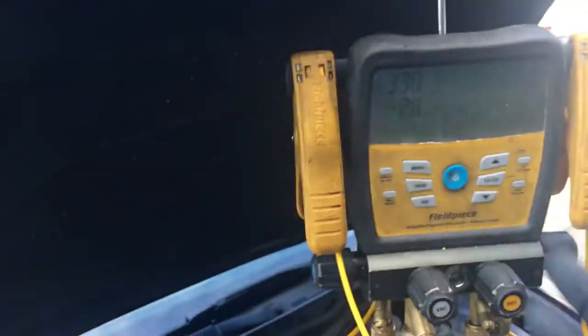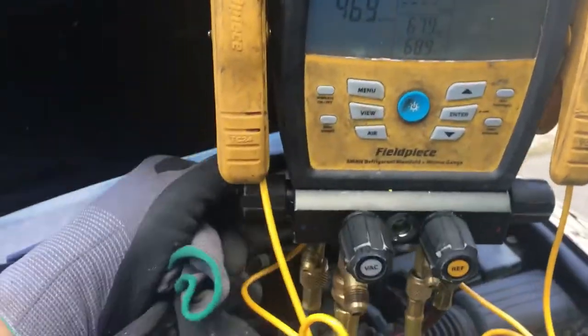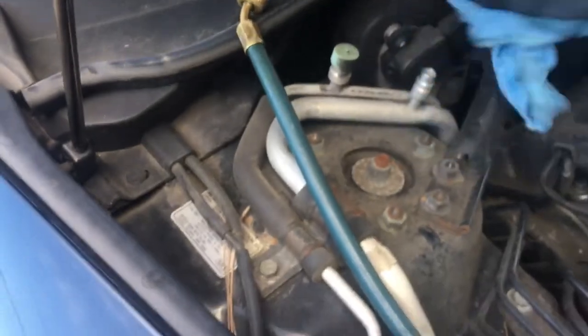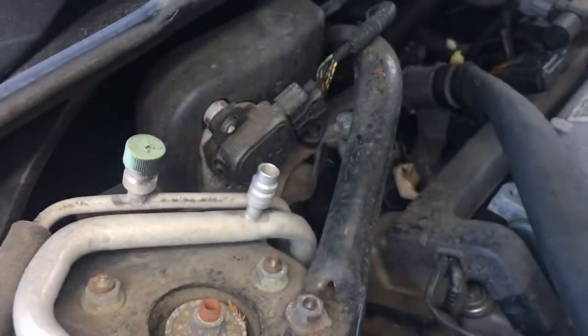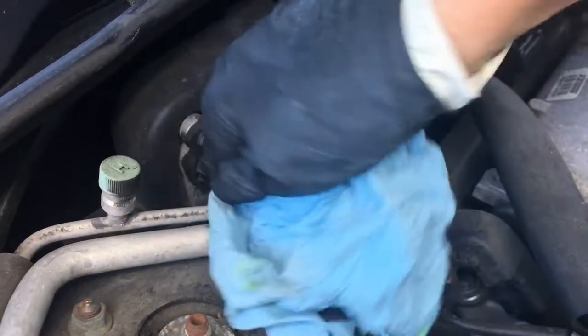I always vacuum out my gauges and fill them up with nitrogen between runs. Let's shut off my gauges and hook up. First of all, you don't want debris or dust — blow it out really good with your air nozzle. You don't want debris down inside if somebody left these off before. This is your sealing surface where your o-ring seals right on this flat surface — you want to make sure that is clean.